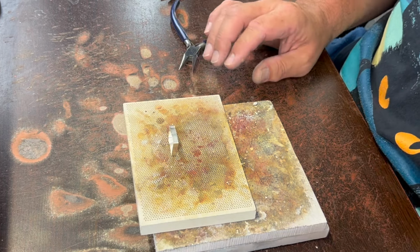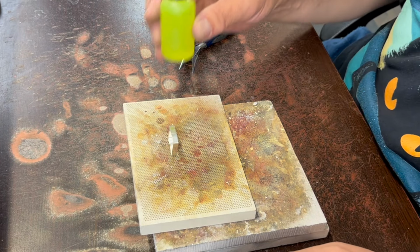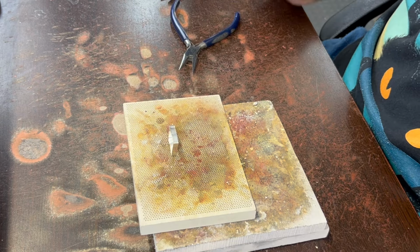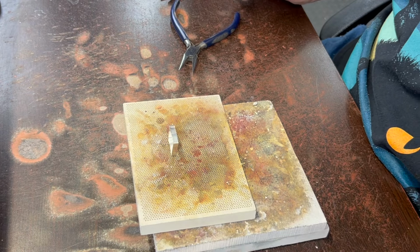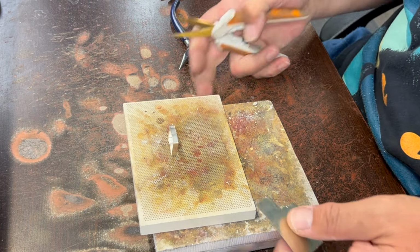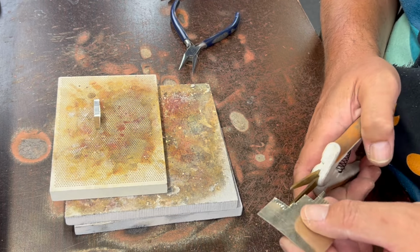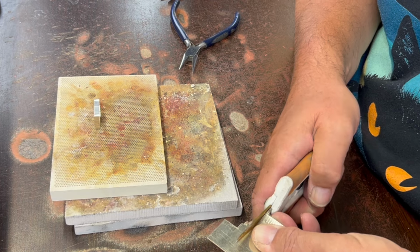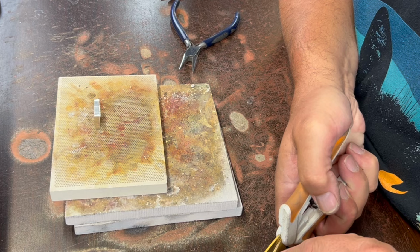So if you've never been to my channel before, I use hard silver sheet solder for most everything. I use a liquid flux that I dribble on, generally, and sometimes I spray it on. And my torch is a Silversmith acetylene air torch, which is a great torch, and perfect for silversmithing as far as I'm concerned. I use a number one tip on that too. And that's the majority of the questions people ask me as far as my equipment. I used to get a lot of questions about these shears. They're just Fiskars craft shears. They work pretty well for a lot of thin metals.